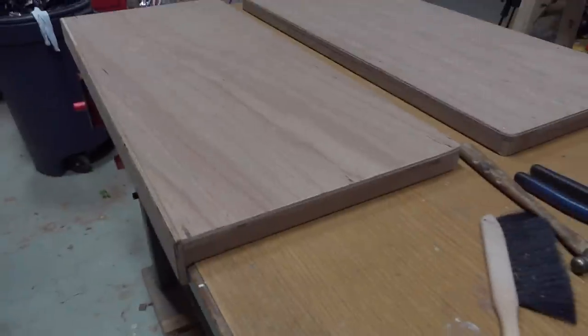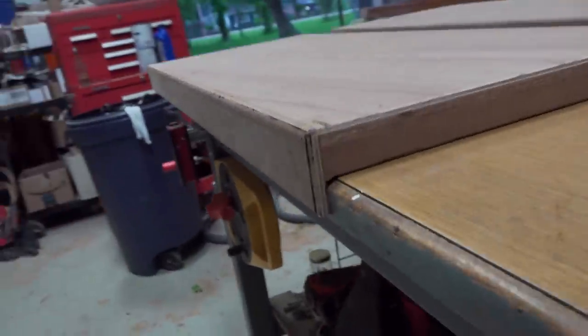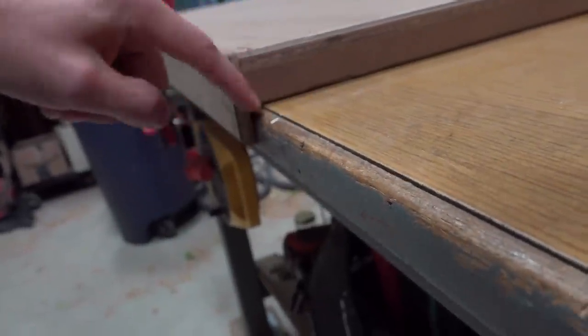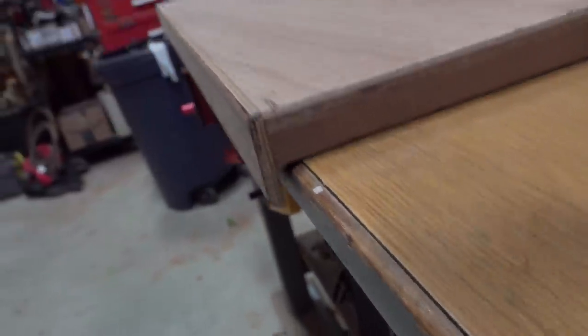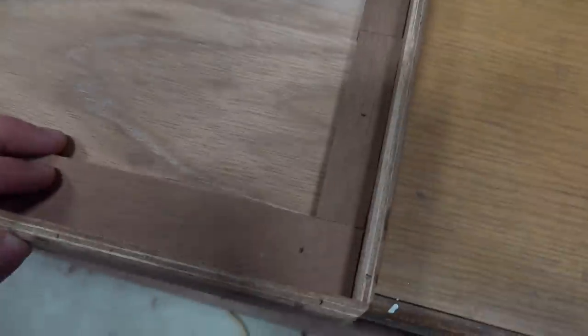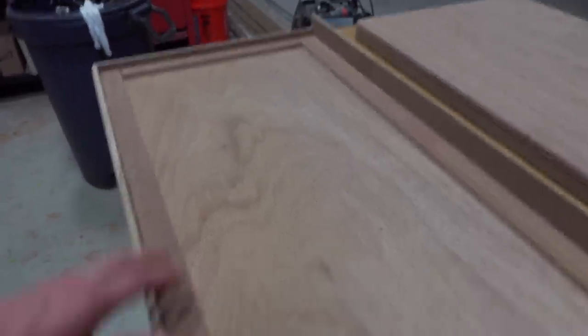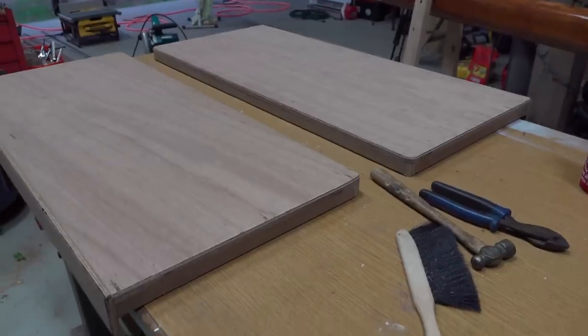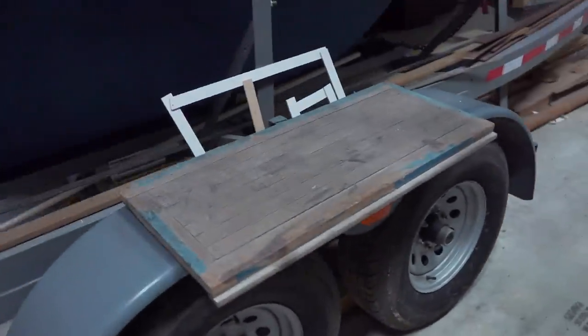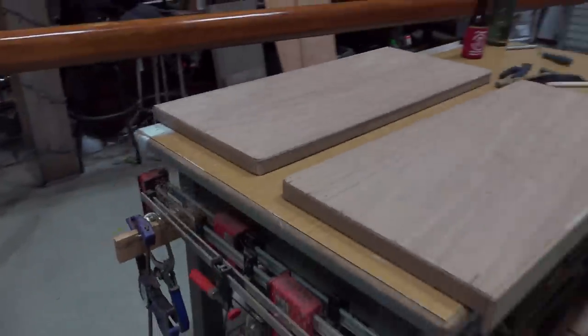So this is the new design. It's all just half-inch marine grade plywood, then I've got some little strips on the sides and I've given it a little lip so that it hangs down past the locker so it shuts down better. Underneath it's just some little furring strips to make it stand up and give me the right height, and then this is just 3/8 plywood and I just tacked all this together with a small nail gun. I'm going to come back and add some fillets in here and seal this up really well, and then the top will get a layer of fiberglass over the whole thing. So it's not going to be as cool looking as the teak, but it'll be a lot more practical and work better. These are pretty much ready to be glassed up.